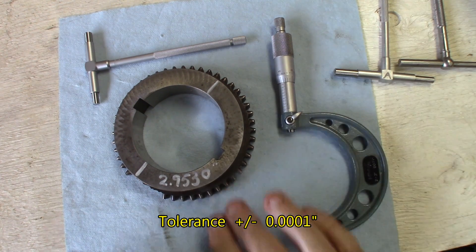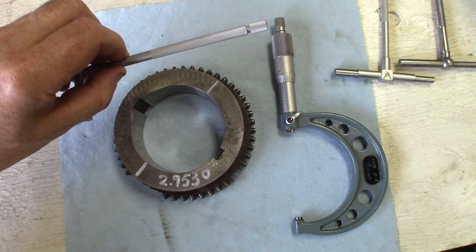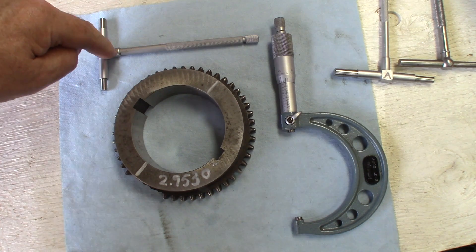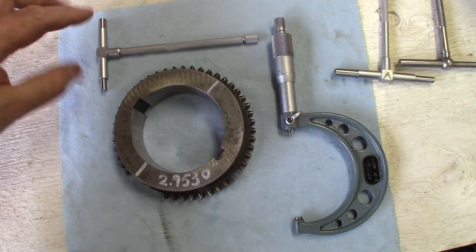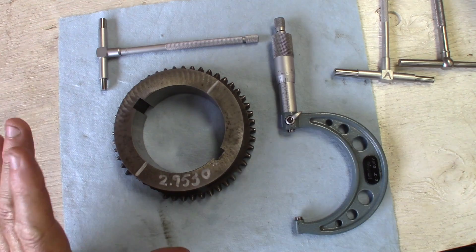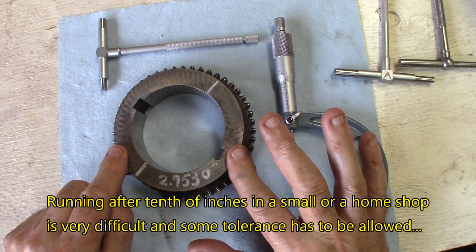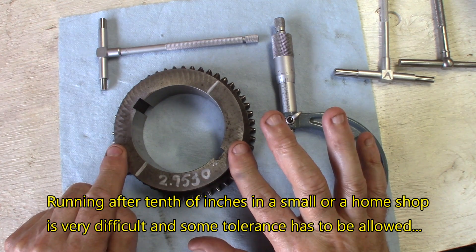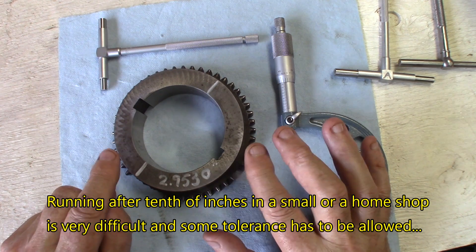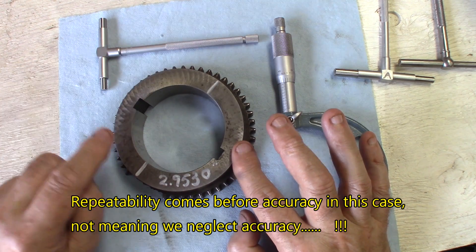This is an interpretation tool, not a direct reading tool - you're not getting the measurement directly on this. So the tool itself, the operator, the micrometer might introduce small errors. The more steps you do to get to a final measurement, the more error you introduce. So take that into account when you measure, and you really need to practice to get repeatability and accurate measurement.